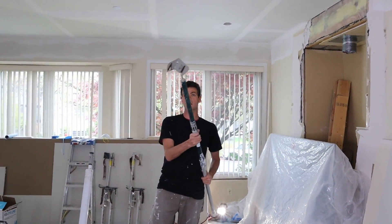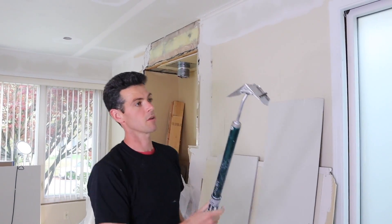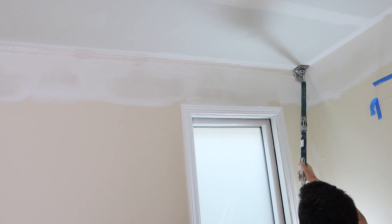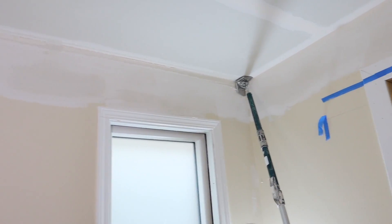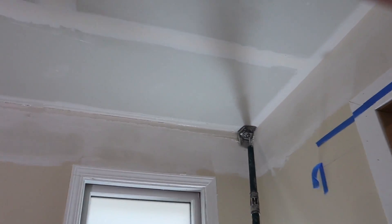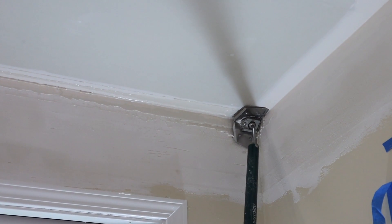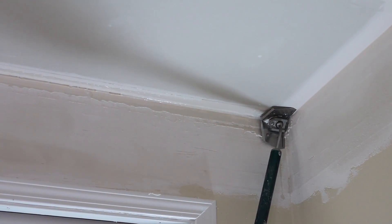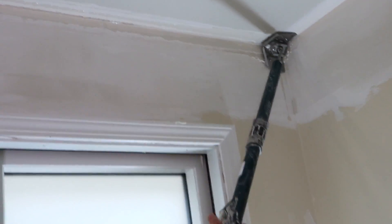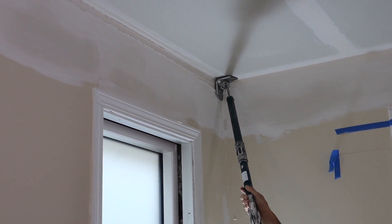We get this extended — this is the three and a half inch one. I taped it with the two and a half; this is the three and a half. Just start here. Here's a critical thing: what you're looking at is the bend in this thing. The reason it has that bend is you want to visualize that it's going right into the corner at 45 degrees. So if you're down here it's going to be making your corner out of square, and if you're up too high it's just going to be hard. You want to imagine that it's in there at 45 degrees and just run it down the wall.